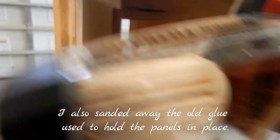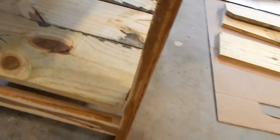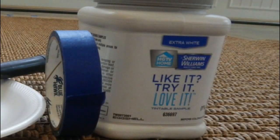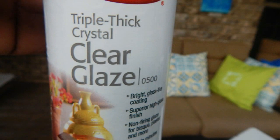It makes a great selection for small projects like this one. The boards were $1.25 each on sale — I purchased three of them, which was a huge savings. The custom cut paid off and everything fit perfectly along the sides. I used the same eggshell white HGTV paint I used for my rug border and small table — it was only $4.98 for a large container, about 31 ounces, and got the job done with multiple coats. Once the paint was dry, I finished it with Krylon clear glaze instead of polyurethane, because polyurethane would have caused the white to yellow.